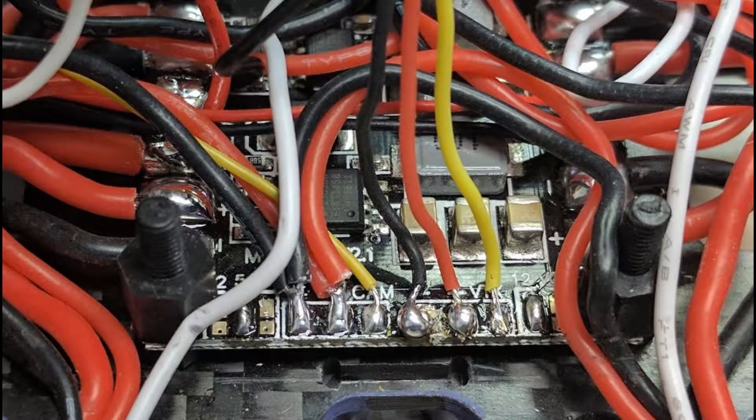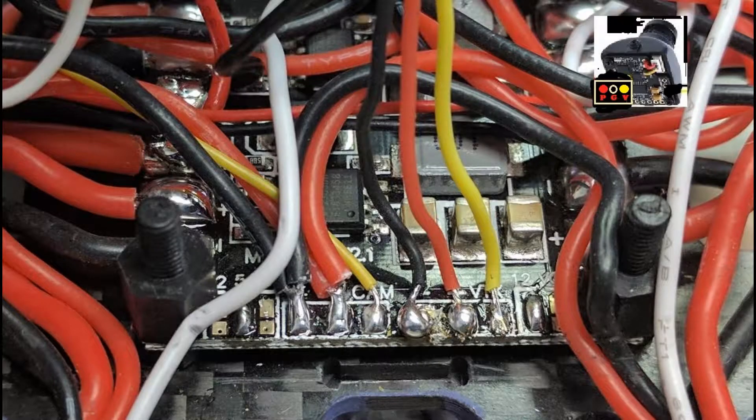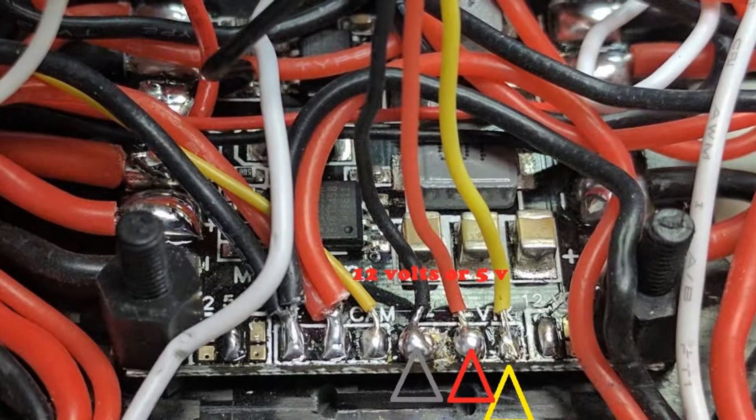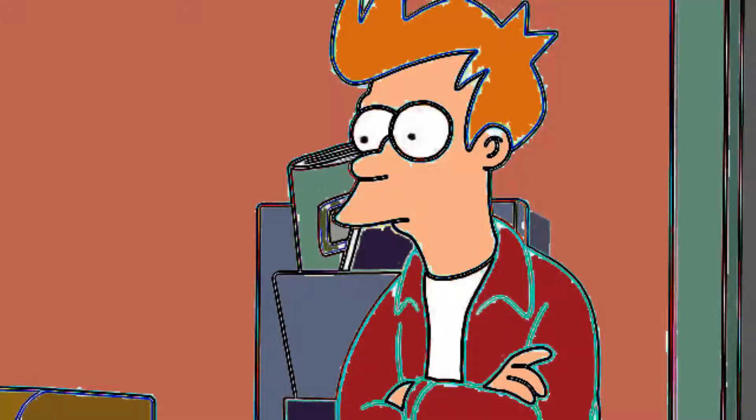What we've got going on here is the three wires to the right on the bottom. We're looking at the right side — the yellow, red, and black — which goes from your flight controller. The yellow one goes from your camera to your flight controller for the on-screen display, and then to the power distribution board, and then to the VTX. It's all networked together with the video, the hot wire, and the ground. In my opinion, I do not have a degree in this, but I've found that this configuration for the on-screen display creates a lot of video noise.